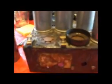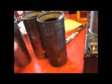The other thing I wanted to cover, these tube shields are supposed to be grounded to the chassis. And as you can see, that's pretty rusty right there. I don't think that's providing a very good ground. And I want to show you already what's happening here. I thought this chassis was black. Not quite. You can rub some of that away. Look at that silver coming out already. This has only been on here about 10 minutes.